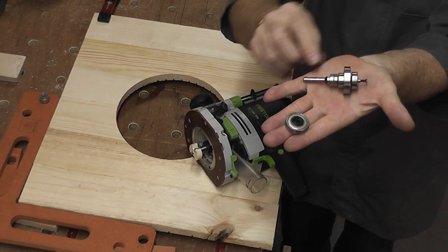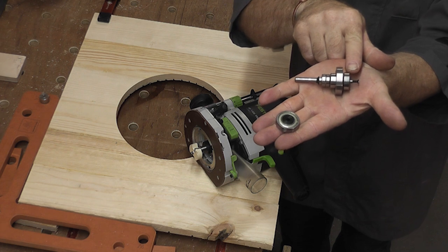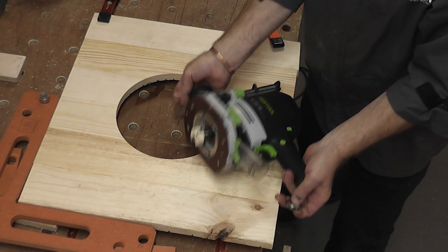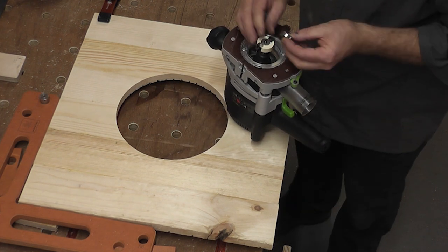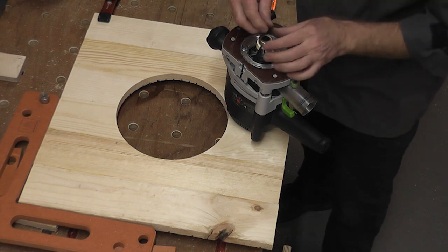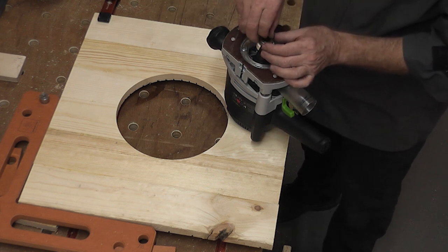I've taken off the one that we've measured. That's the one up on here. We're going to need it in a second. Going to change it for a slightly bigger diameter. So just going to set that up. I need a spacer washer, the bearing on, check the bearing spins, the lock screw at the top.